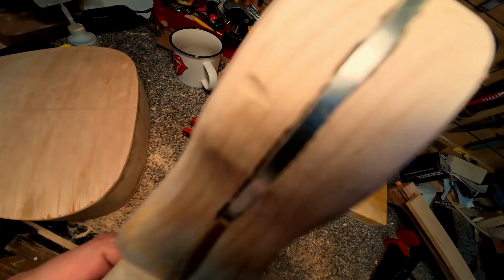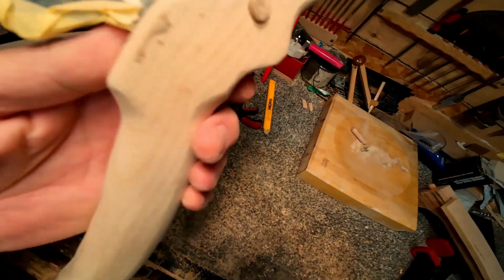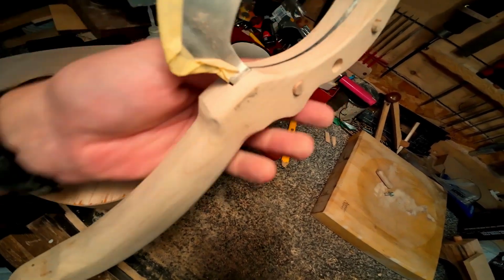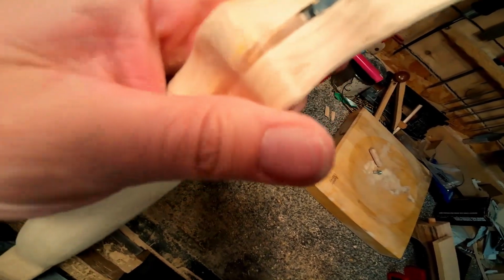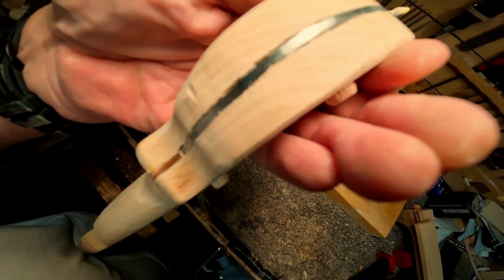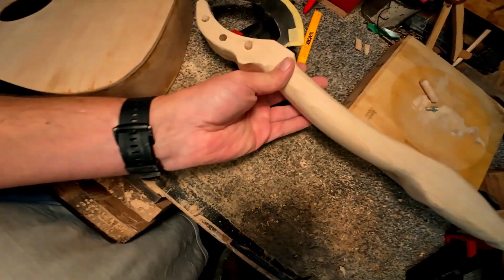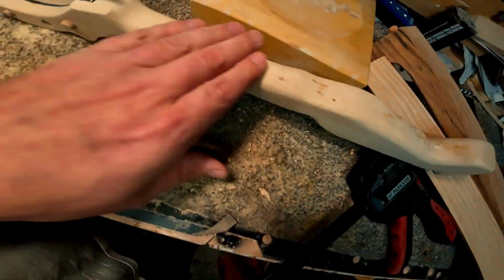There's still a little bit of a gap in between the metal and the wood, but what I'm going to do, I'm going to get some epoxy resin to fix this in. And then once I've done that, I'm just going to get some wood filler, just run it up through the gaps and sand it down in there. It looks sweet. It's got to be clamped a bit anyway. So, next, I think, is the epoxy resin. I'm getting that fixed in there.